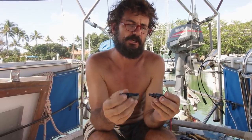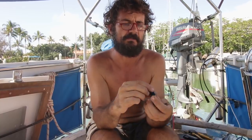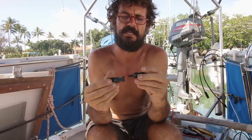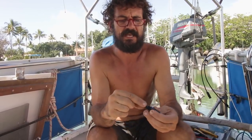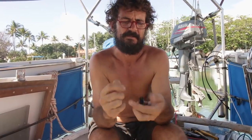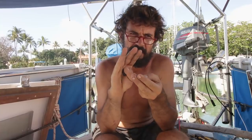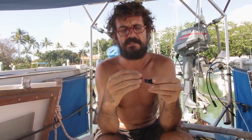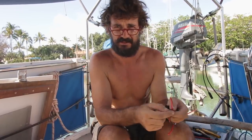These are really great fittings for a yacht — they'll only need to be splash-proof, but IP67 is a really high rating. What makes it so is a rubber O-ring that engages when the two fittings go together, connecting the electrical contacts inside. Where you connect at the back, there's a rubber collar that goes inside little fingers. When you screw the cone-shaped fitting on, it squeezes all those fingers evenly — much like the aperture on a camera — and that O-ring shrinks down and grabs onto the wire, making it watertight.